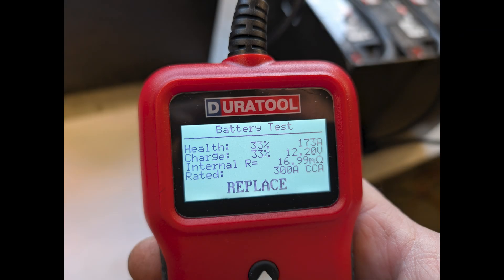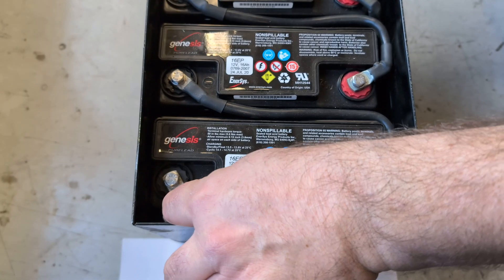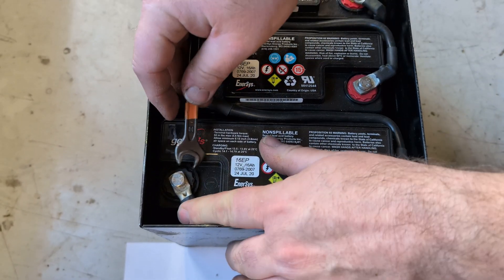The results show if the battery is OK or should be replaced. Here is a picture showing the results from a bad battery that needs to be replaced. Remember to always switch all three batteries in your S30 XE unit. Check for any loose cables and tighten them if needed.